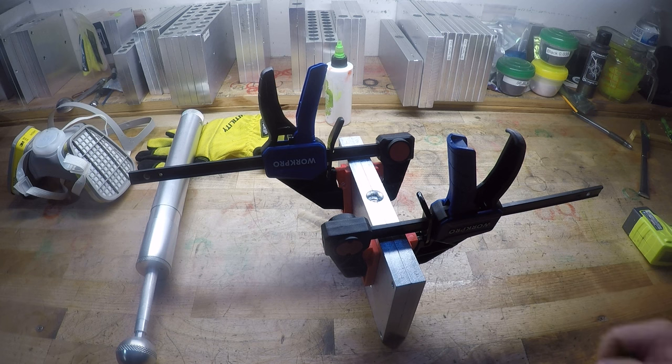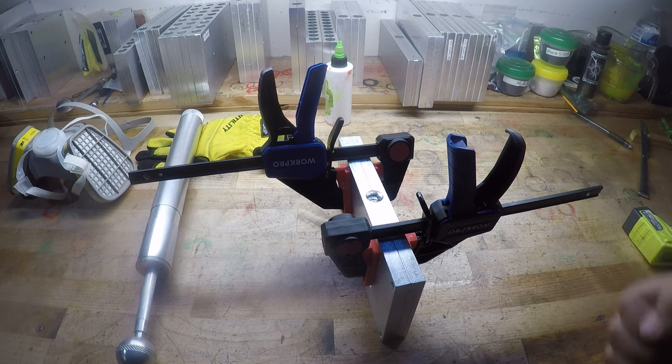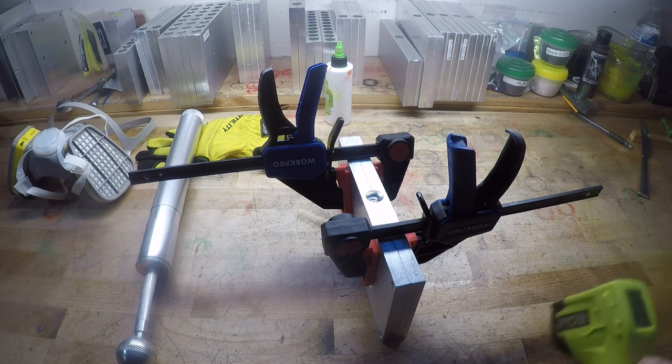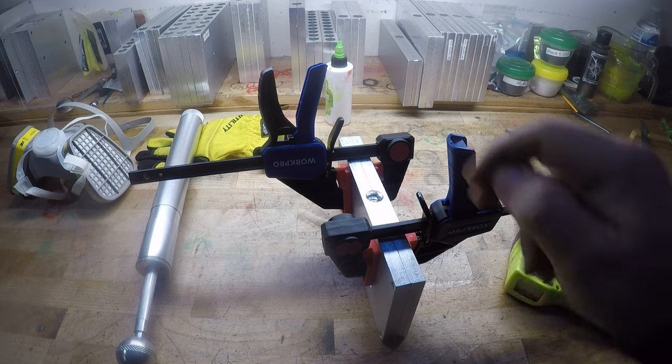But you notice how I'm swirling it up when I'm taking the temperature. I'm not trying to get just the top of the plastic. I want to get a good reading of the whole thing as a whole. So I'm trying to swirl it up, get everything mixed up as I take the temperature. And I'm looking for 300, 305, 310, somewhere in that area. And I'm going to shoot it into this mold.